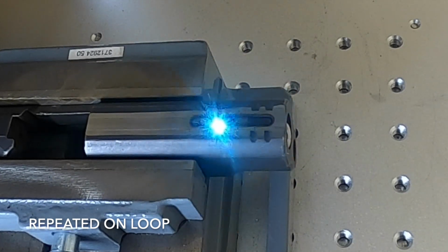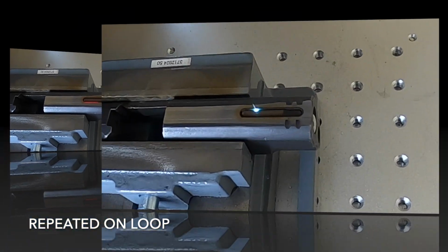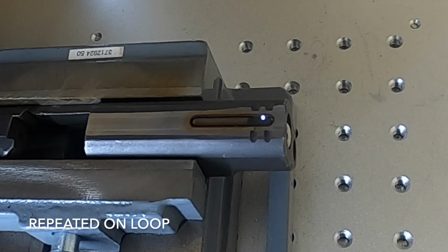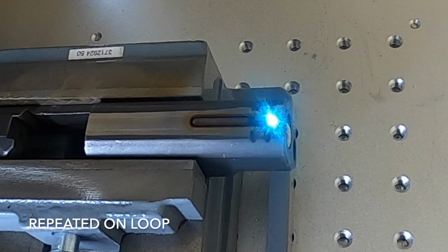It's doing that at the right side because, again, as we've mentioned before, that's the thickest area, and that's where it's doing its final little last bit of cuts. But getting brighter along that bottom edge is a hint that we are almost through everywhere, because that is the result of the piece trying to fall through, but being held ever so slightly by some area.